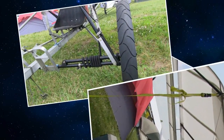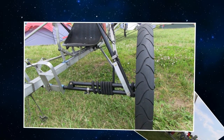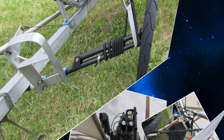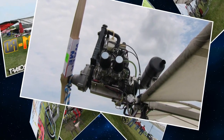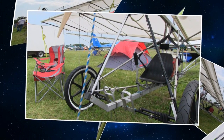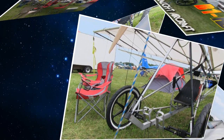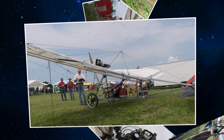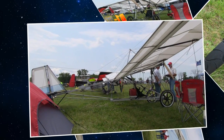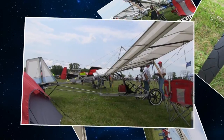It looks like you've used the basic airframe though, although some of it in the back has been changed. The main tube coming off the bottom of the seat? Yeah, because the gas tank was originally up on the wing — it was a motorcycle gas tank — and I'm kind of opposed to putting that much weight up high. I wanted to lower the CG, so I put the tank down below the CG line on the wing. I see you're running a 582 with a gearbox rather than belt drive. Well, I'm using a gearbox and a 582 because that's what I had. I seized a couple of smaller engines and had some difficulties, and unless you're made of money you use what you've got.